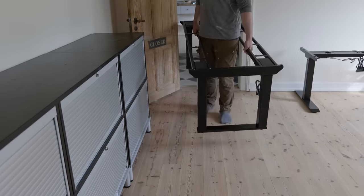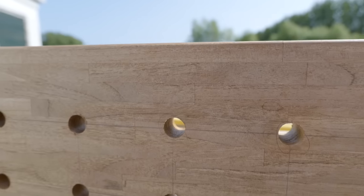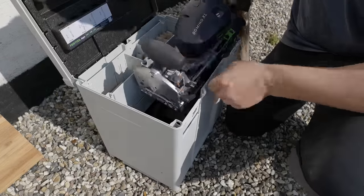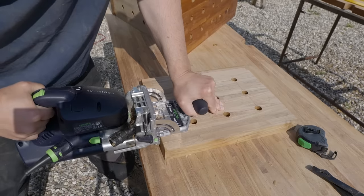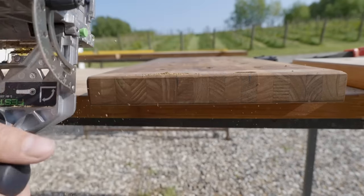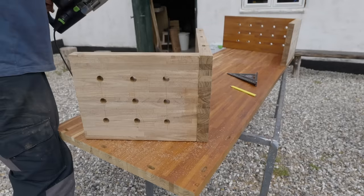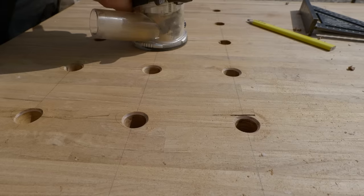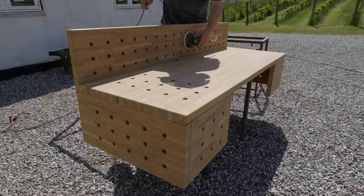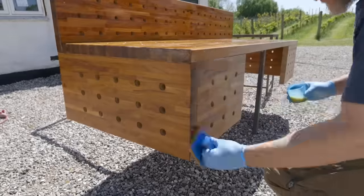I totally forgot - I have two table bases and I still have the second tabletop to go. My plan is to make some kind of workbench out of the old tabletop - an indoor workbench for my office, height adjustable. I have this idea that there should be both horizontal and vertical work surfaces and it should be full of dog holes so I can make or buy all kinds of hold-down tools and other stuff that fits into dog holes. I use the Festool Domino to join all the pieces together - the only thing holding this together is dominoes and wood glue. I sand it down to 150 grit, remove all the dust with raw wood cleaner, and give it a good massage with Rubio Monocoat Oil Plus 2C Pure.